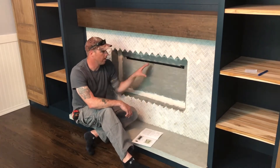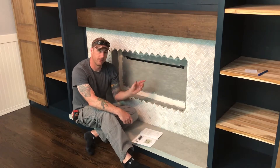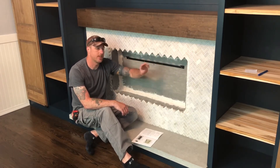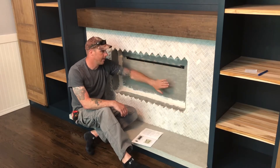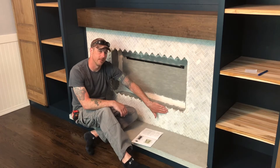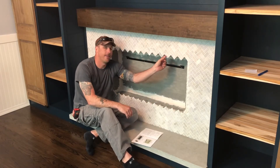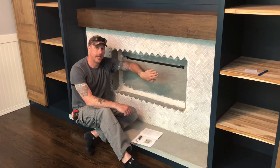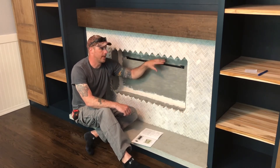The next crucial step is making sure you have the proper depth — six and three-eighths inches from the concrete board to the finished wall of your fireplace. For example, these tiles are three-eighths of an inch thick, with about an eighth to a quarter inch of thinset, and then the concrete board. The reason this matters is that when you place the fireplace onto the support bracket, it will stick out about a half inch, so if you don't follow those exact dimensions it'll either protrude too far or sit too far in to hook onto the mounting brackets.